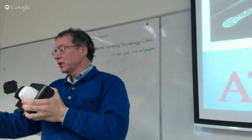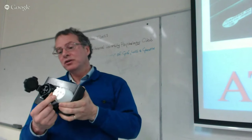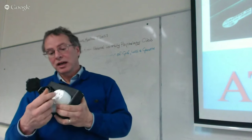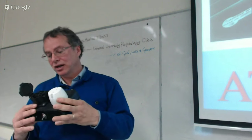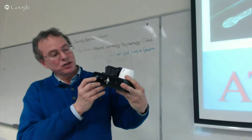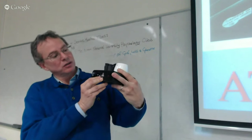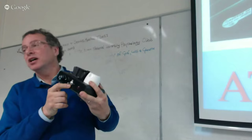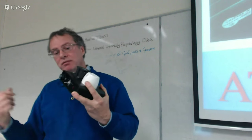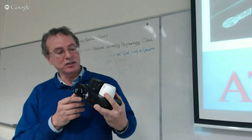You can plug the lead from the commercial charging station in here. It's got a 15 amp outlet. J1772 is rated up to 32 amps, so 15 amps is not full potential. You can then plug your power in there and charge with it. I also put a fuse in the adapter for protection. With J1772 you really require an on-off switch as well. In the off position, the charger will recognise that there's a car present and it'll come up on the screen, but it won't start charging. In the on position, the actuator goes in at the charging station and the car starts to charge.